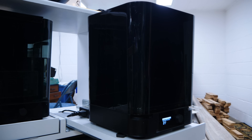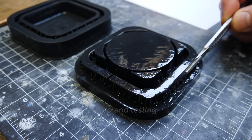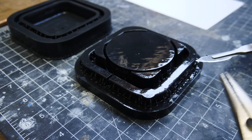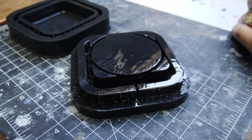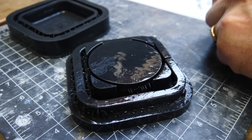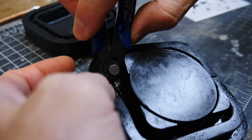You have to print a couple of resin parts and clean them really, really well to sort of get that stickiness removed. You can kind of see that here. I'm placing this in the Form Cure — you use the regular Form Cure to cure these silicone parts. Since I'm 3D printing these molds for the first time with this material, there are some adjustments I had to make. I needed to avoid the cupping situation, so you can see some cuts so that the mold doesn't have suction generated during the printing process.